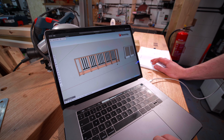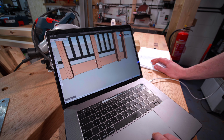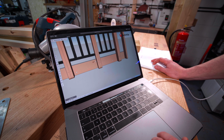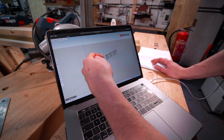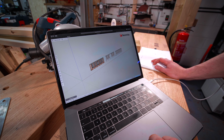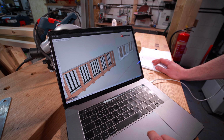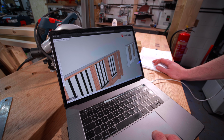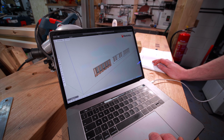And then this top bit, well, actually, these are coach screwed into the beam. And we are possibly going to be adding retaining straps to it as well to prevent any twist of that beam should a load be applied from the inside of here, and stop it from twisting. And then the other thing is, it's just going to be coach screwed from the top into the end grain there as well, because there's not any risk of that stripping out because of the load that's going into it. That's pretty much everything.